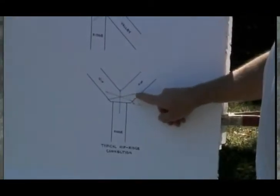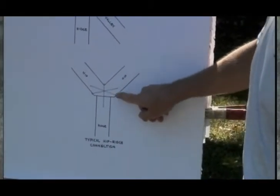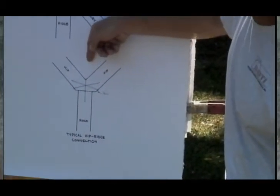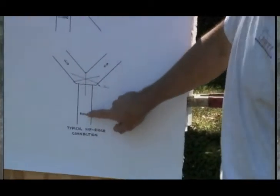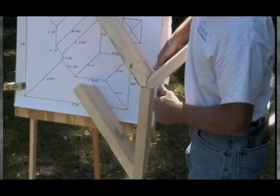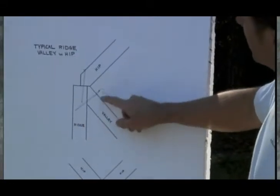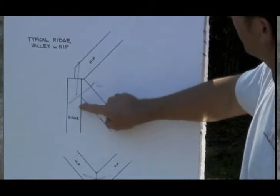You will notice how the two faces come together and are secured with number 16 nails from either side. Some care should be taken to ensure the complete immersion of the nails into the wood. Whether using a nail gun or hand drive nails, a slight angle in the nail approach is required. Then you'll notice, as the ridge abuts the flat face of the hip rafters, you nail through the joint into the end of the ridge member.